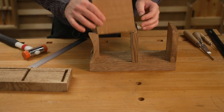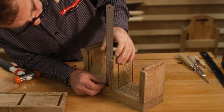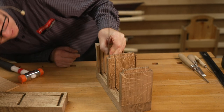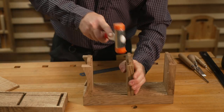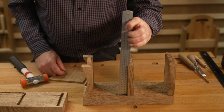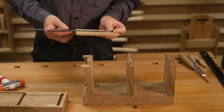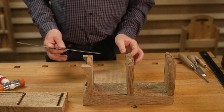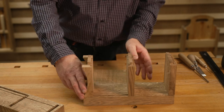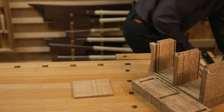So next thing we want to check is how deep we are this way. So if we go into here, just going to bring that round, slide in. I've got to turn it round, I'll turn it back to you guys in a minute. I have got 129 on there, okay. 129, we've gone to the bottom of the groove and we've got to add 6, so we need 135. I've got spot on 135, all right, which some of you say, great, but actually 135 is tight, it's not allowing any movement, so I'm going to take